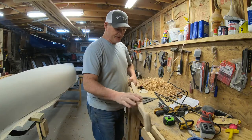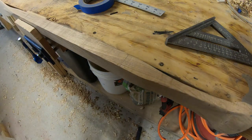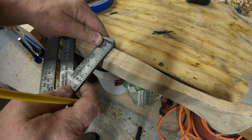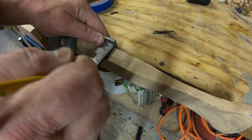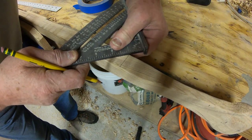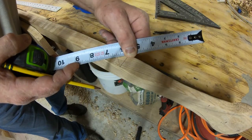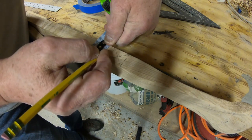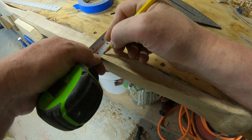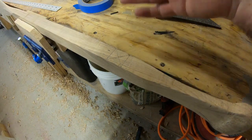The next step is to shape the shaft and this will be the last step. I'll scribe a line — I've measured in four different locations and I'm at an inch and an eighth. Using my contractor square and carefully lining up the diagonals. I'm going to mark three quarters of an inch from this side and then measure three quarters of an inch from the opposite side, and repeat these measurements down the length of the shaft on all four sides.